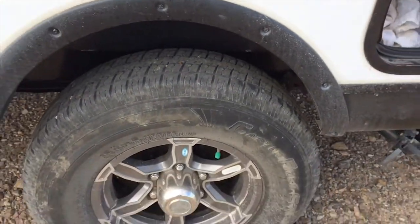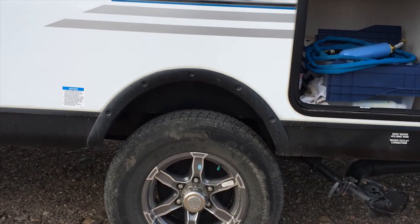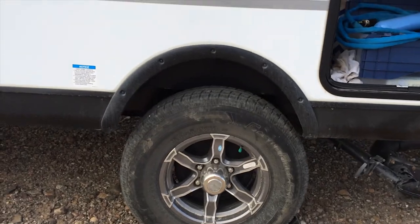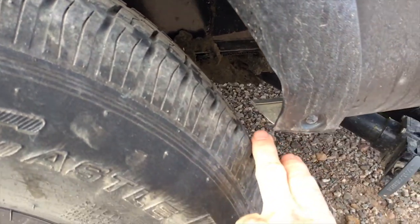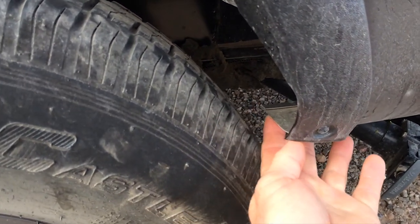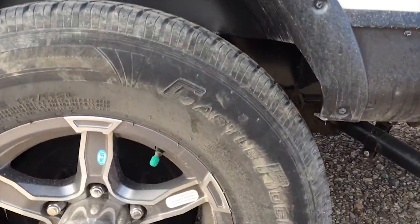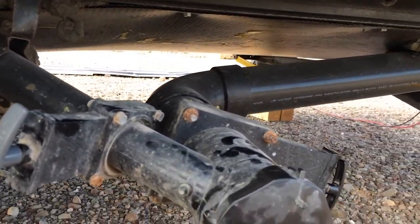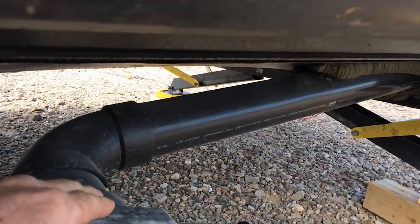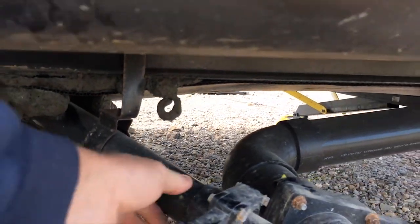Once the silicone changes color just a tiny bit, it's all over the place and it's ugly. The wheels — they didn't even center the wheel. They didn't even center the axle under the trailer. So as you can see, it's off by several inches. We have one finger of clearance in between the back here, so if it goes up into the wheel housing, it's going to hit and bend up the whole corner. This side has three fingers, so it's off by an inch and a half. It is a Dexter Torflex axle. The sewer line just kind of hangs out here — it's full of sewage right now and there's no support. The only support it has is this little strap on the inch-and-a-half line.